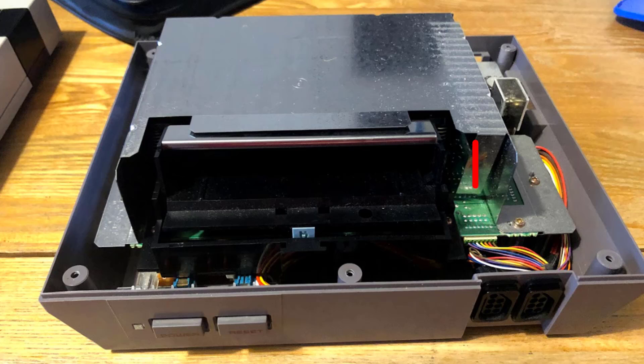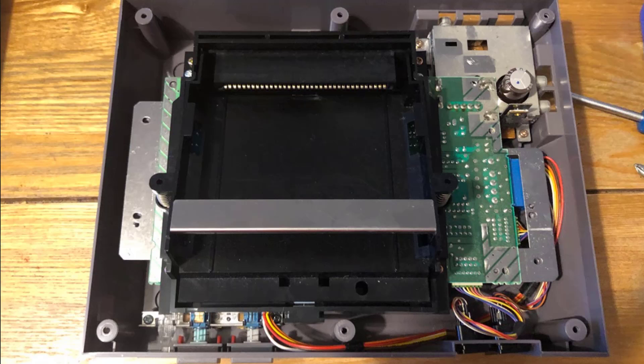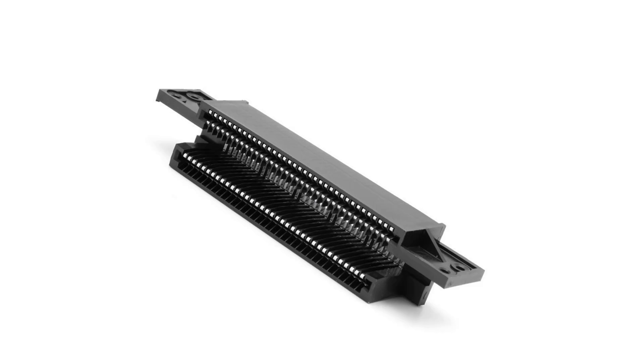With the lid off I took out a couple of screws to remove the heat shield — there are some more on the back. I was going to remove the cartridge tray. In the top right corner you have the power unit. You will need to remove four screws to remove the cartridge tray. There are two at the back which you don't want to remove because that is part of the tray. When you do take those screws out, it releases the 72-pin connector which we will be working with later.